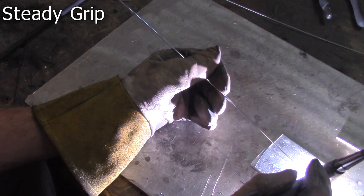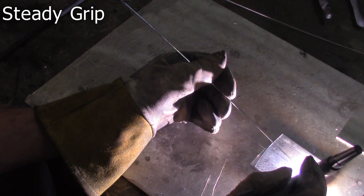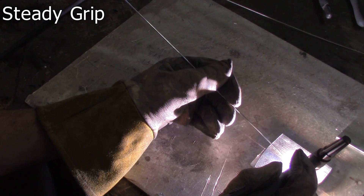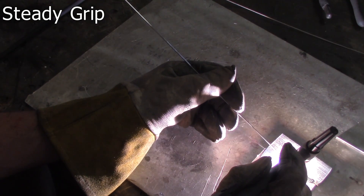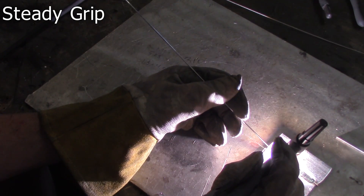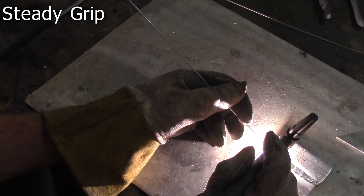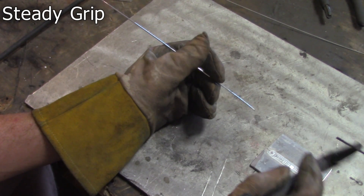With the steady grip, all you do is hold it steady and chase everything down just one dab at a time — dab, dab, dab. We don't advance it, we don't feed it, we don't push it. This is recommended for beginners because it's very easy to focus on your actual weld without having to worry about feeding or advancing the rod. But the longer you weld, the closer you get to your fingers, and the more likely you're going to burn your fingers because there's not a lot of rod left. But it's a great way to start out.